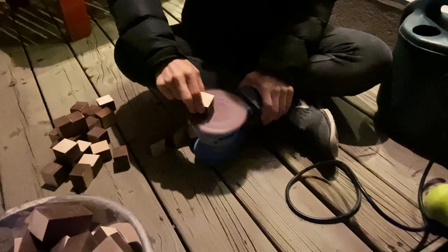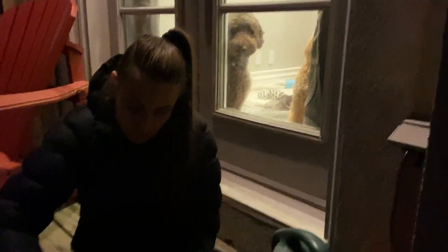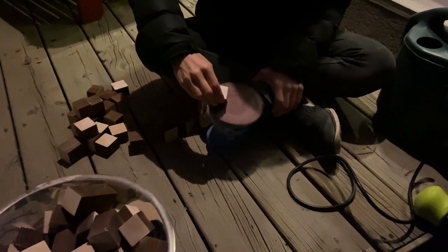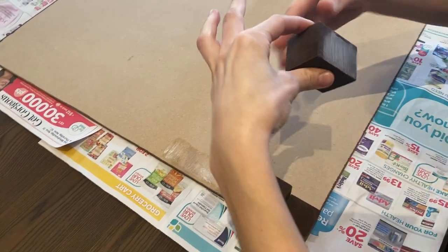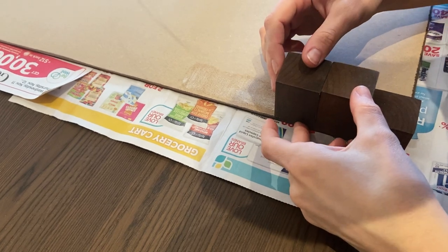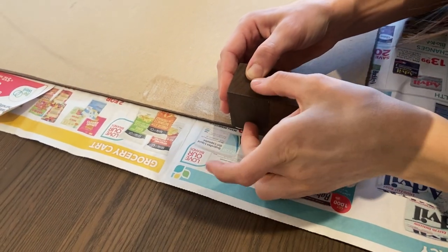After a lot of cutting it is now time to sand down the faces. I propped a circle sander between my feet and gave each one a quick spin — my whole body was buzzing after this, but it worked so I guess it was worth it. I'm missing some footage here, but I went ahead and stained the tops. Keep in mind that since the tops are cut against the grain they're going to be more porous and absorb the stain more quickly, so I only needed one coat here to get the same color as the sides.